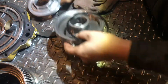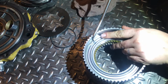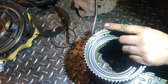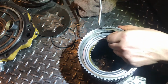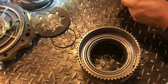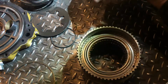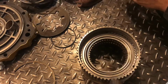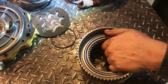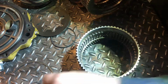As far as the symptoms that you were having, it's not so much the O-ring missing on the oil pump. Yeah, I actually don't think that did anything aside from leak. And the thing is, reverse felt awesome. I didn't check pressure on reverse. I kind of wish I did. So if the oil pump, and okay, pumps don't make pressure, but if the oil pump was worn to where it couldn't make pressure, you would think that reverse wouldn't feel as good as it did. You would think.